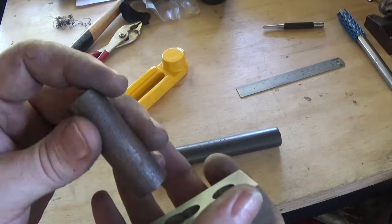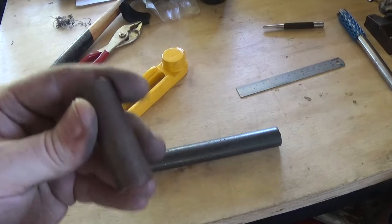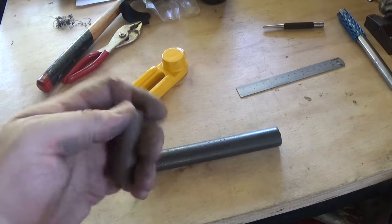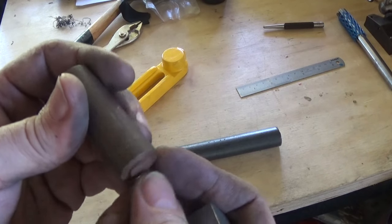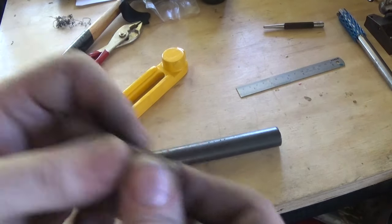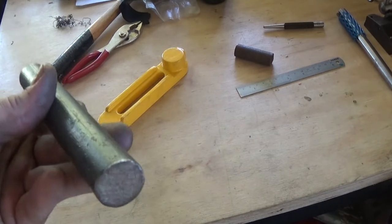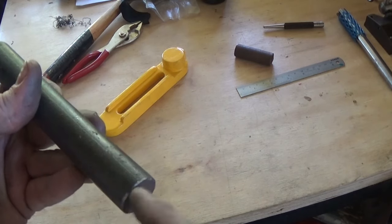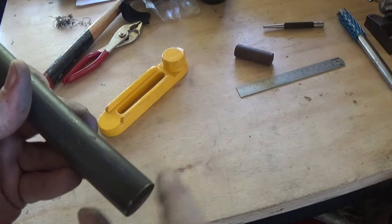but if we machine this down on here, we've also got a weld surface, and I think I'm going to braze this in here. I've got a weld surface that's actually sitting on the casting, and I haven't got a hugely big weld surface, and it's just not going to work. So I've got this, and we can put this in a bit of 25mm black steel, and it's plenty good enough, I think. I'm going to cut a piece off and machine a step on there to go in there and clean up the outside nicely.